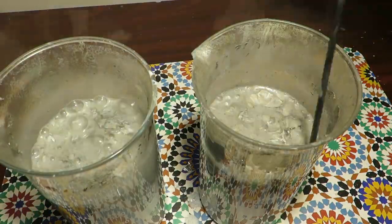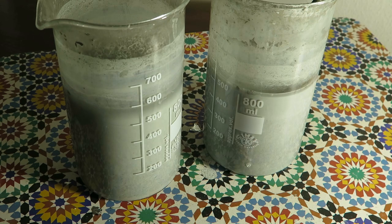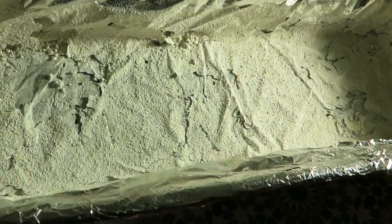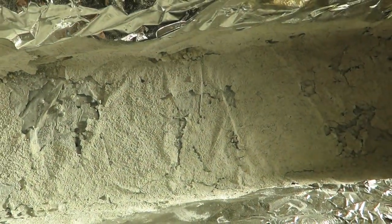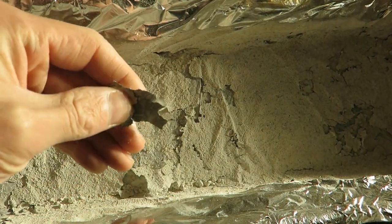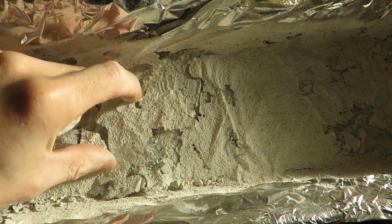When the reaction is over, you will end up with something like this. You can clearly see that the container on the right side releases some hydrogen still. If you can boil this for another hour or so, it would be really nice. The final step is converting aluminium hydroxide to aluminium oxide. This can be done simply by heating the slurry to about 200 degrees or higher. I have done that in a tray like this and it's quite corroded, so I covered that with aluminium, which wasn't really a good idea as you can see, because it ate it.